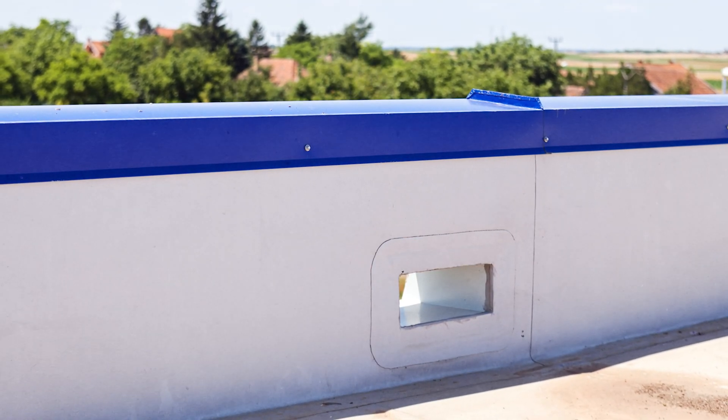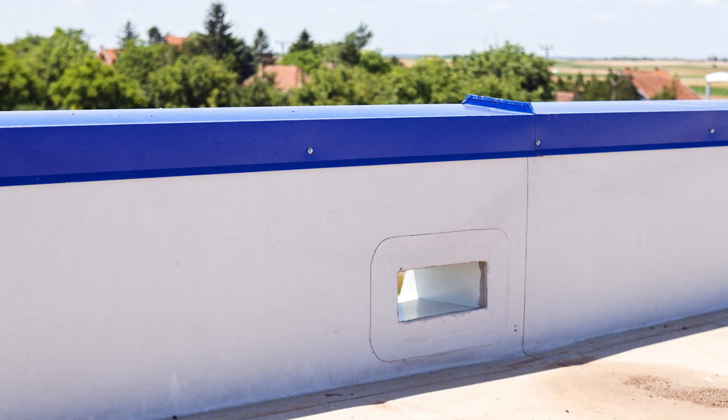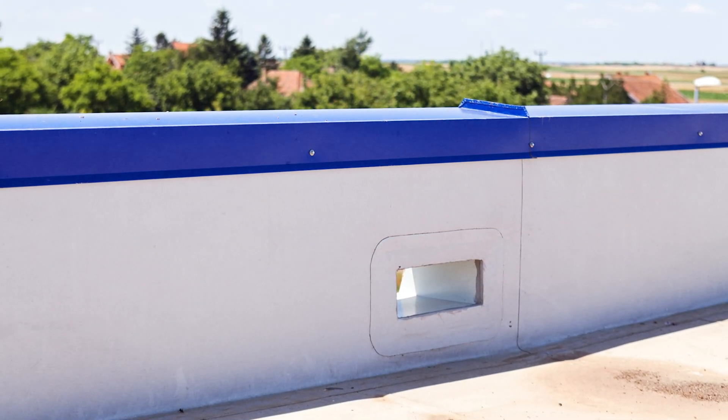The material is usually specified by whoever's designing the building — typically anywhere between 26 gauge and 22 gauge metal. Both paint systems are used: SMP paint systems or Kynar/PVDF finish paint systems. Sometimes a lesser paint system is used if it's going to be covered up by the flat roofing itself. But a lot of flat roofs have coping caps or parapet walls with coping caps on top, and in those visible areas you'd want a better paint system — a PVDF system could be beneficial for long-term performance.